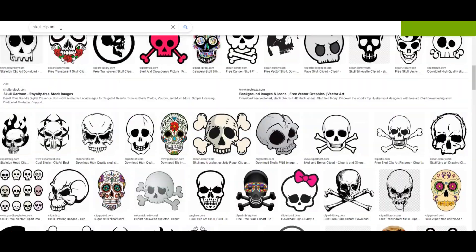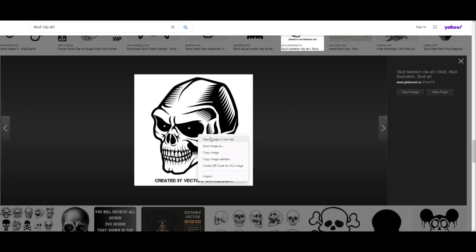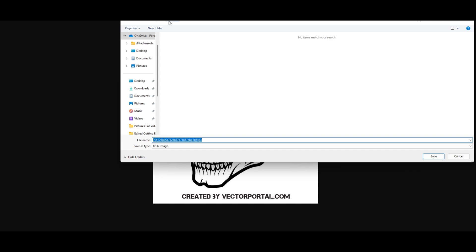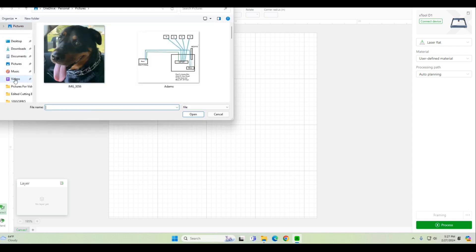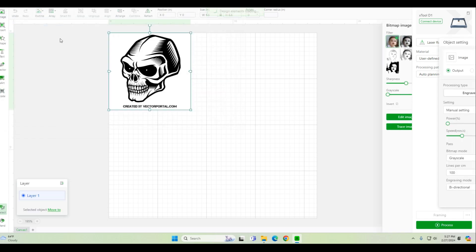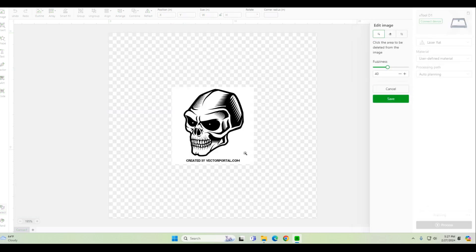For an example on this tool, I'm going to put a little skull logo on it — because if you've got a company logo or anything you want to put on there, you can go online, find the picture, open a new tab, save it in a file where you can find it. Then go into your X-Tool software, go into Image, and find the file you just saved. Once you import the image, go to the image editor on the side and cut out the pieces you don't want or trim up the picture. I want to get rid of the name below and clear up around the skull to help with alignment, because the X-Tool doesn't know the difference between a white splotch and the actual skull — if you line it up wrong you might print off your project. So you want as tight a picture as possible.